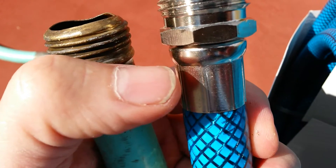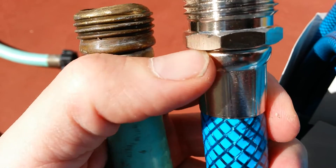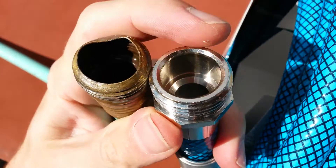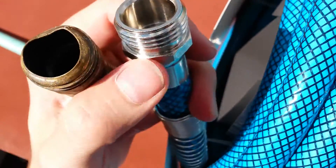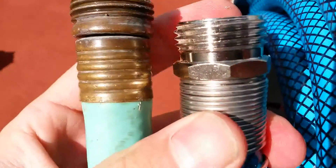Since that's a solid metal, and it's crimped with a nice solid band right there, you're much less likely to get a leak. Plus, you're going to get a much better seal at the top on your washer, because it's not just thin brass. Really good to go with a step up.